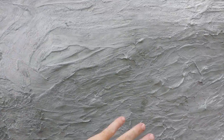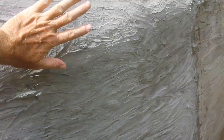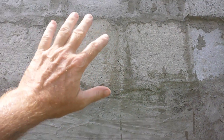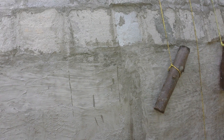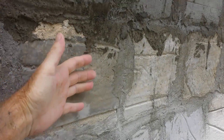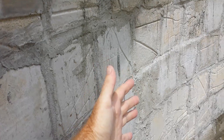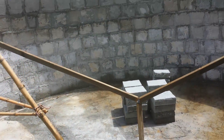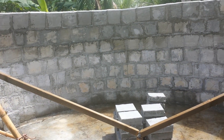This wall over here is completed all the way around, and it makes it a pretty solid individual piece when you put the fabric on there as we go around. The higher up we go, we'll continue to sand this and put screening on it. My intention is to sand this inside wall also and put some screening in with the mortar at least up to a certain level — and if it's easy, I'd like to do the whole inside also, so I get a sandwich of the inside and outside wall between the screening reinforcement.